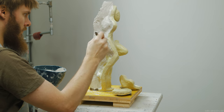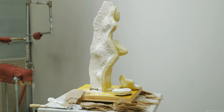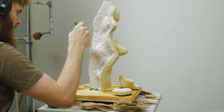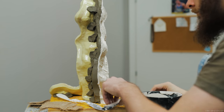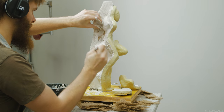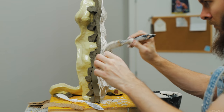Use a soft bristle brush of appropriate size to brush the plaster onto the surface. For the splash coat, we are after a thin but even layer of plaster — thick enough so that none of the silicone shows through, but not thicker than a few millimeters. An uneven layer could cause warping, so we want to make sure all our layers are pretty even. Let the splash coat dry a little bit until it's firm to the touch; this takes around 15 to 20 minutes depending on your mix, the temperature of the water, and the climate you are in. Plaster can struggle to bond to itself if you let it dry for too long, so once you start this process, keep going until the piece is done.